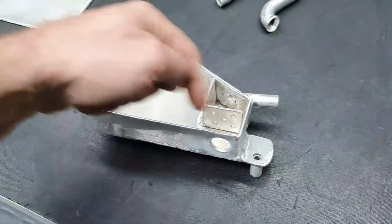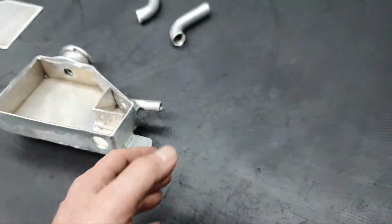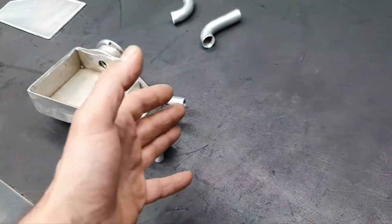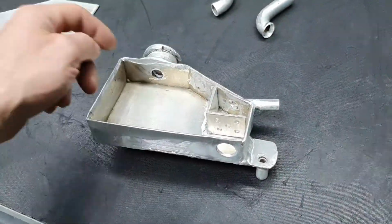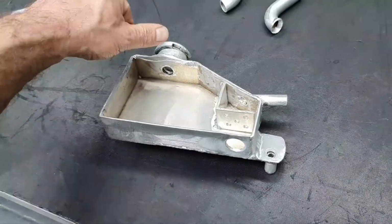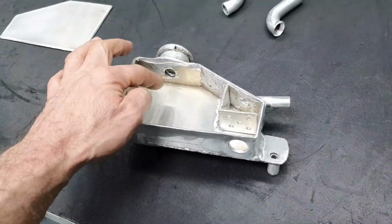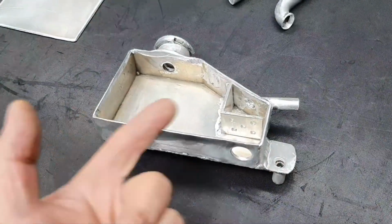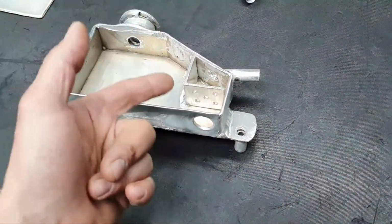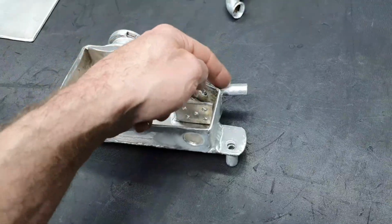That means you put it in, and then after half an hour, you start it for a couple of minutes, and you switch off the engine. Then after half an hour, let us say, you see the fluid inside does have bubbles, you top up the fluid and fix the level, let us say on the minimum first. You start again, and then you don't see bubbles again, all right? You're going to create air from the return.